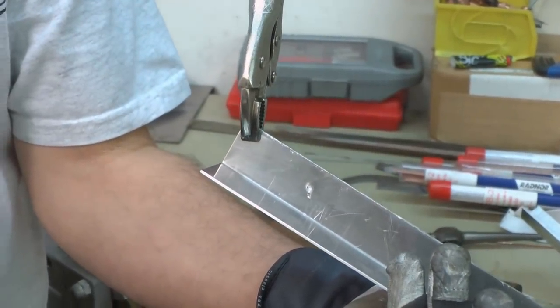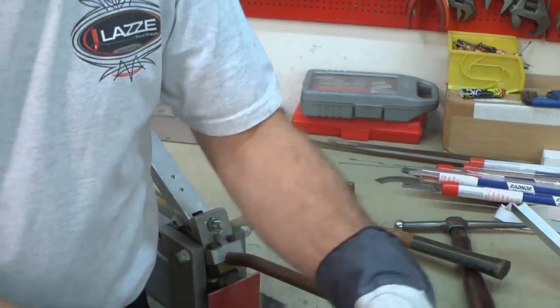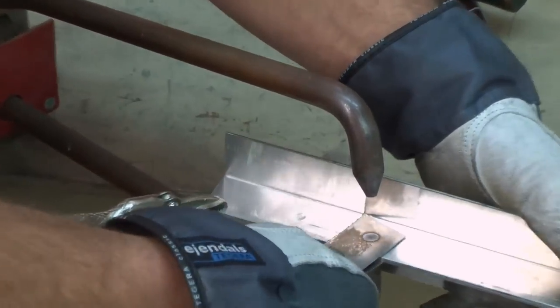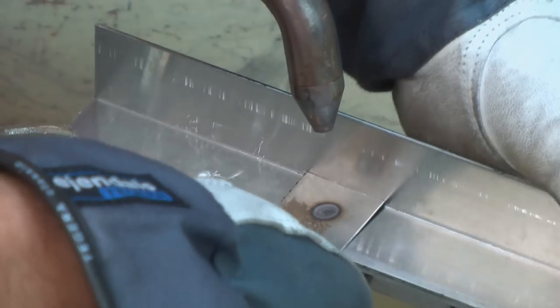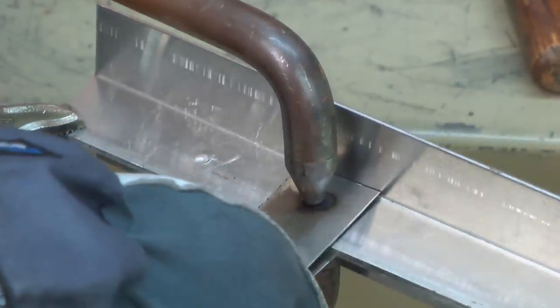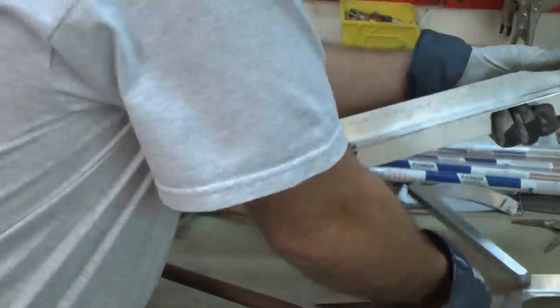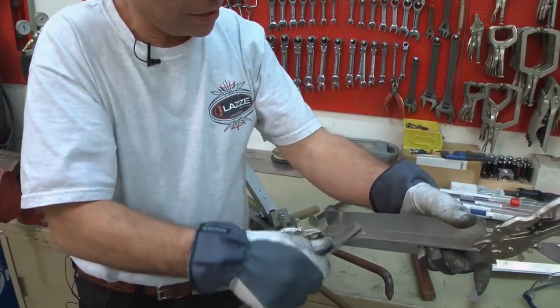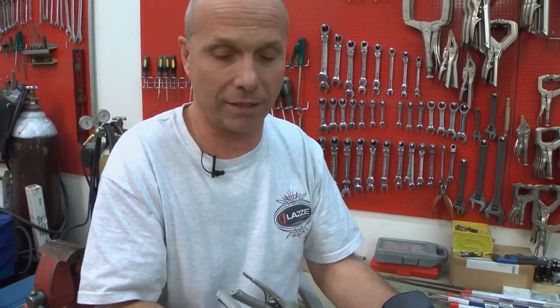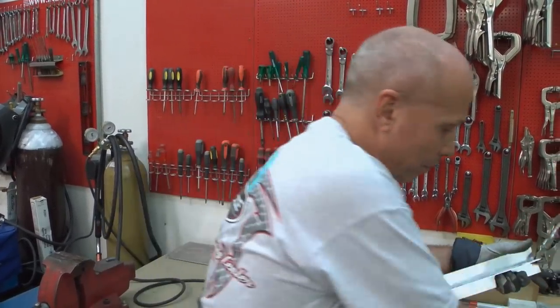That's it — that's how it looks. I'm going to make another one, about two inches apart. Put those two steel pieces back over it again and hold the trigger. But every time you need to move it, because the steel plates actually stick to the aluminum. You can't put a long strip and do lots of spot welds in one go, because you can't remove the steel pieces easily — so you need to take them apart every time.